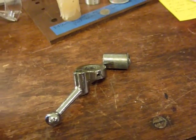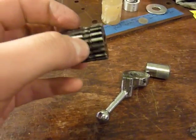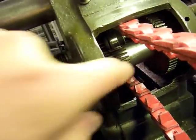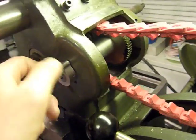I also had the geared sleeve here — it was clearly cross-threaded or sort of mucked up. I was actually able to clean these out, so I think it's reusable. But in the meantime, I was able to find a replacement piece, and then I took some measurements and milled up and turned a piece to serve as the replacement.